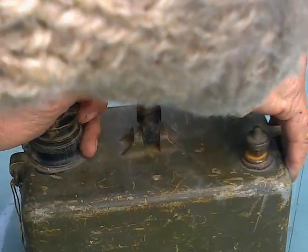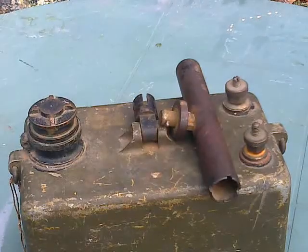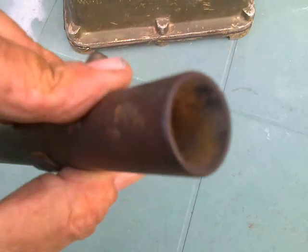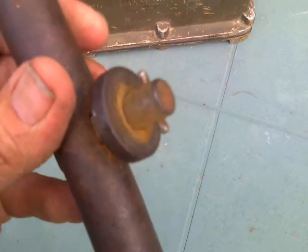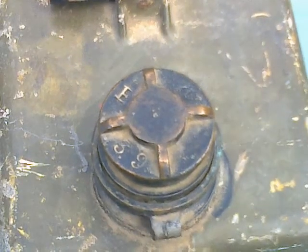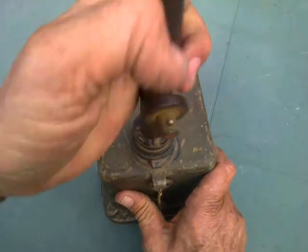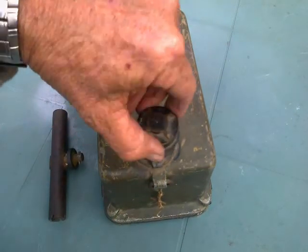It's spring loaded — if you push down and rotate 90 degrees it comes straight off. The handle has four square-edge notches at one end, round at the other end, two little pins. There are four large flat ribs on the end cap which engage with the notches on the handle.